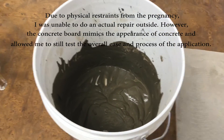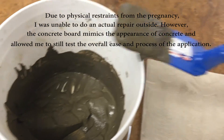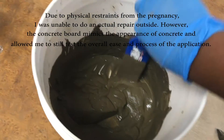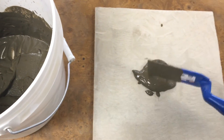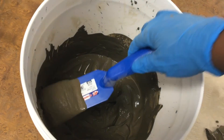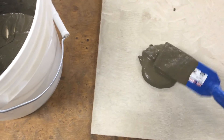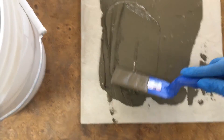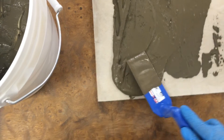After getting it to the right consistency and free from lumps, it was time for the actual application. The mixing itself was pretty easy — it was like baking. If you can make cookies or pancakes, you can mix up this product. Using my plastic trowel, I began applying the product to the board. This was a lot simpler than I anticipated; the mixture was very easy to apply, it was like icing a cake. For pitted concrete, this would be the step you'd use to fill in the holes. When I finished the first coat, there were a few places to touch up, but it gave me the chance to get familiar with how the product felt and looked on the concrete.